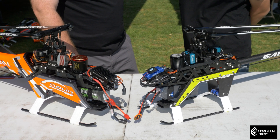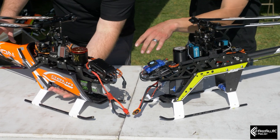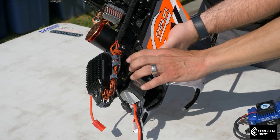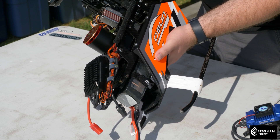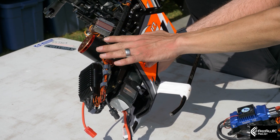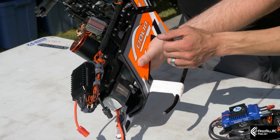There's a ferrite ring that comes with it. With all ESCs, they do come with a ferrite ring. On the 205s, it will eliminate any noise in the line so you have a clean signal coming from your flight controller unit to your ESC. Because these wires run so close to the magnets, they can produce a lot of noise, and this takes care of that for you.